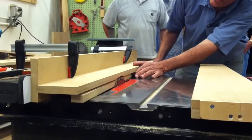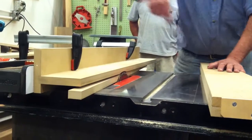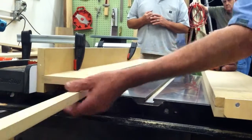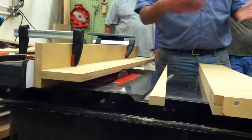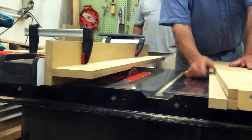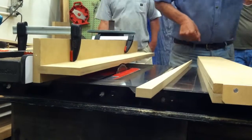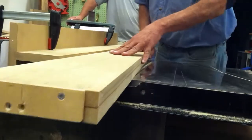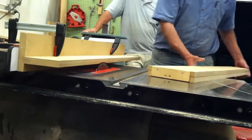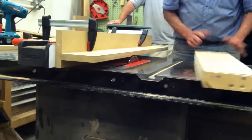What happens when you go through is this piece is in here. You notice that's not tight — I've got probably a quarter inch there, and you need to have enough room so things don't get caught in there. You can get a couple in there, stop your saw, and then just take these out. They don't ever kick back unless you cut too big a piece and it gets caught in here. If you had a really big pattern, you could go to the bandsaw and just quickly saw that off first. So if you make this pattern correctly, I made 26 pieces by going like this, all the way through, then coming around and going through — so then you've got 26 pieces that are tapered.